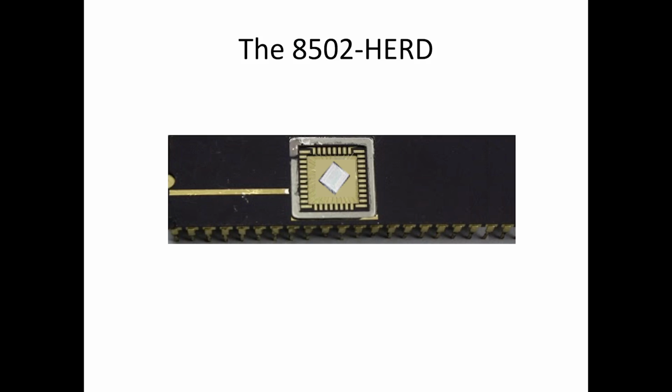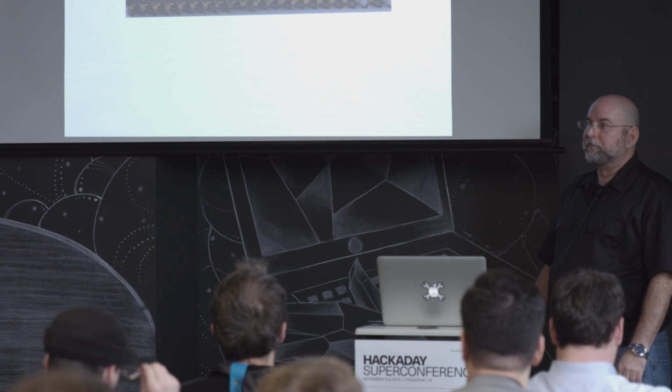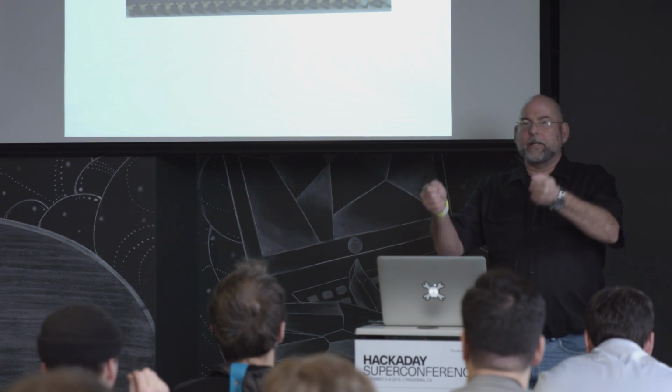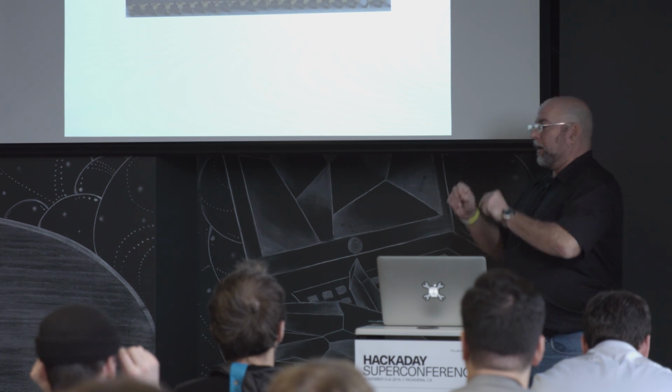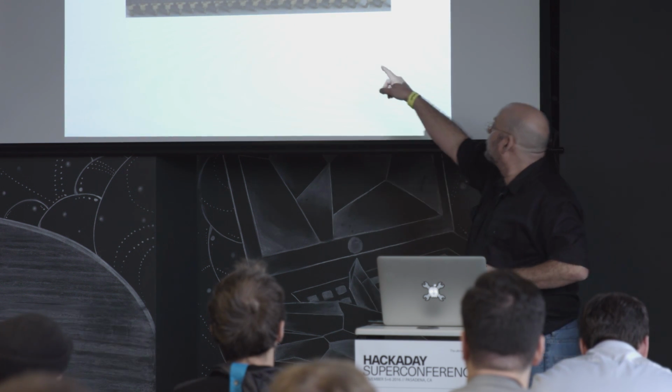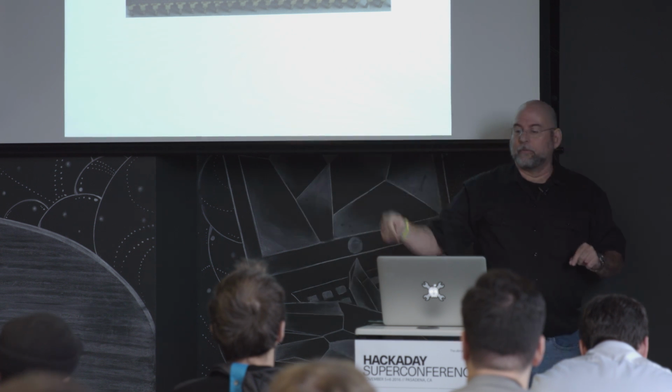Now, at some point, we needed our own 6502 for what we were about to do. We needed a pin bonded out. And true to nature, remember I said we got to go fast enough that we make mistakes? Boy, we made one. We had what's called a bonding diagram, where you take the die and you literally decide which wires go from the die to the pins.